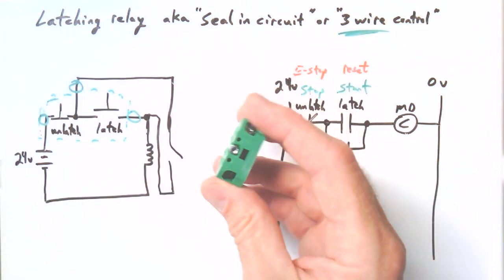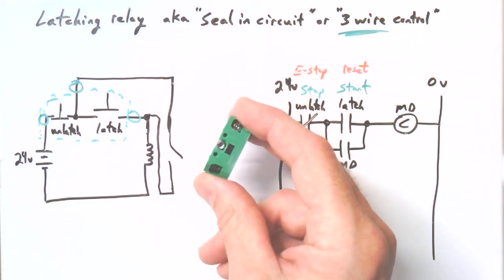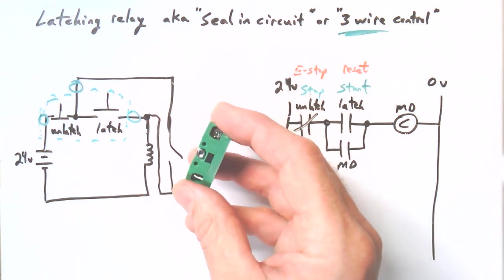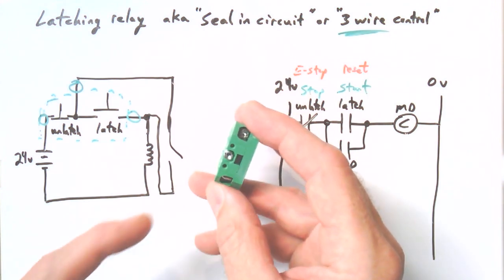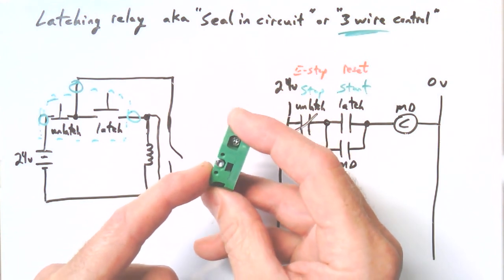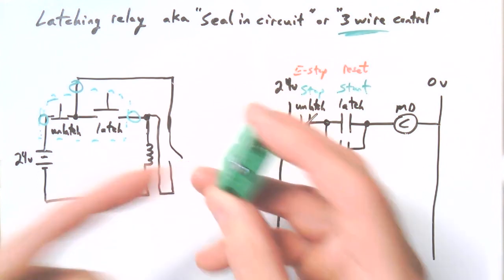So always normally open, and worst case, a wire's loose or off. So it's open and you can't close it because the wire is not there. Well, that just means you can't start it. Okay. But it doesn't mean it would false start. If a wire falls off in a normally open scheme, it just remains open. So there's no start signal generated, if that makes sense.